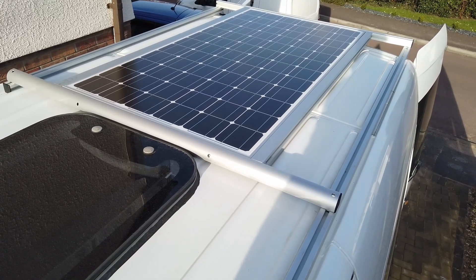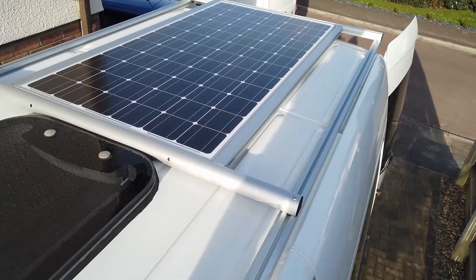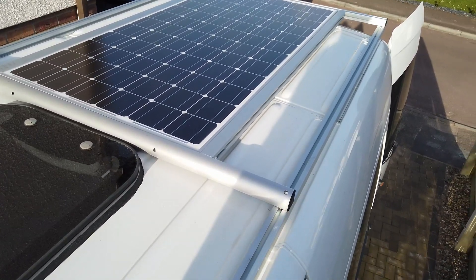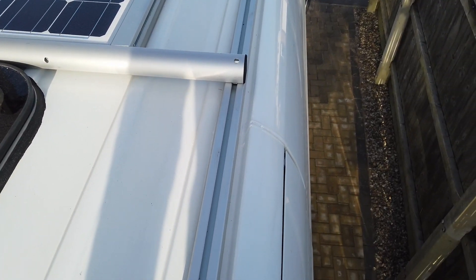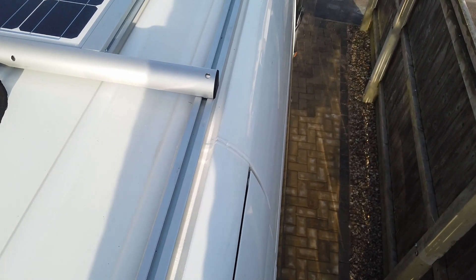This is a roundup of the weekend's work. I've been working flat out to fit this solar panel — 215 watt, 24 volt. I've used my aluminium 4040 extrusion. I put a long piece on the passenger side of the van. This goes all the way to the front of the van and it measures 3.2 meters. It's secured inside to the original Mercedes mounting points.